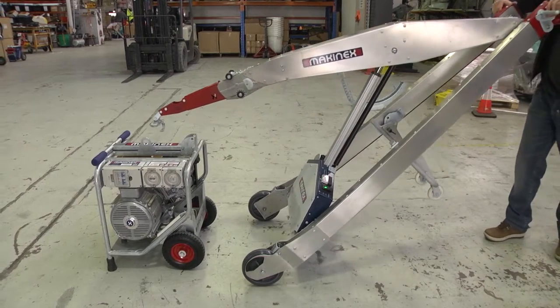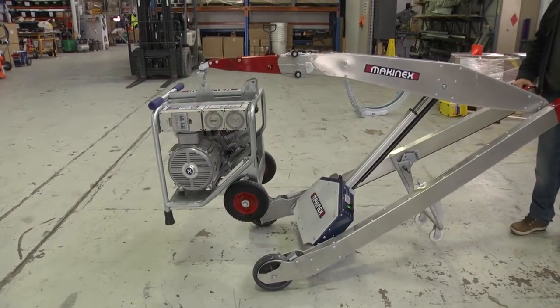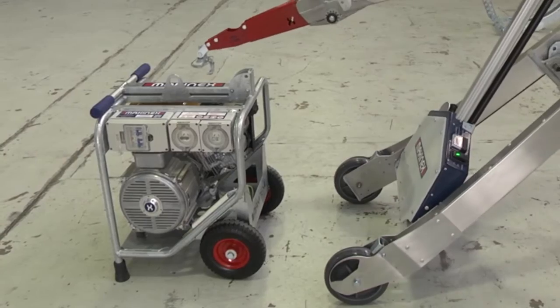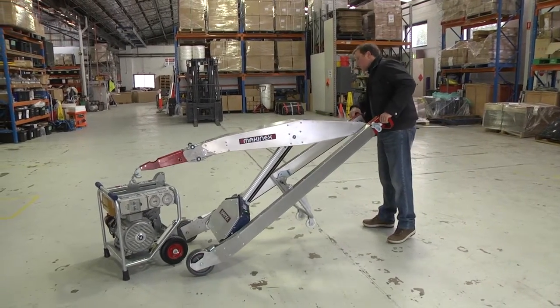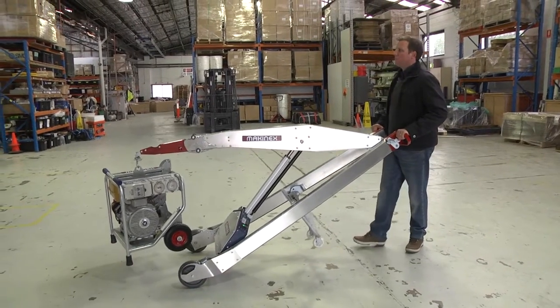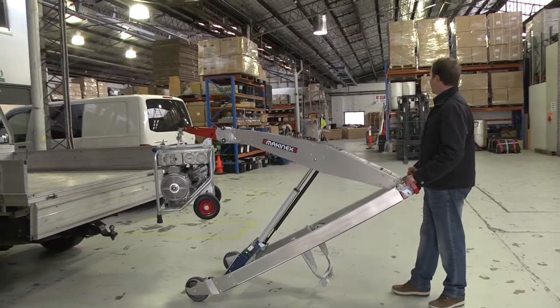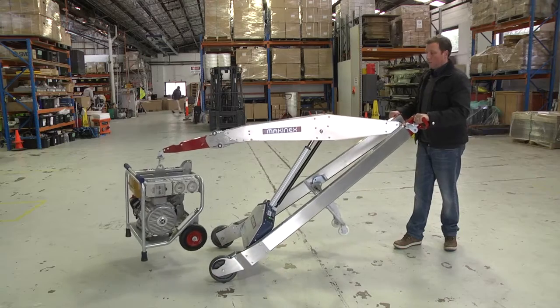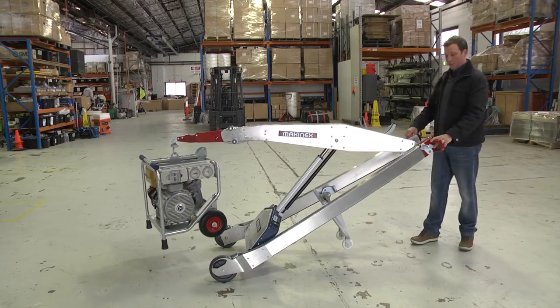before use. Machine principle. As the operator lifts their hands, you can see the jib rotates around the main wheels, moving forward, creating reach, essentially allowing you to move the hook forwards and backwards. As you do this, the balance of the load changes on the hands of the user. More reach means more upward load on the hands. Less reach, then more downward load on the hands. Finding the balance point of each load gives the ultimate control to the operator.